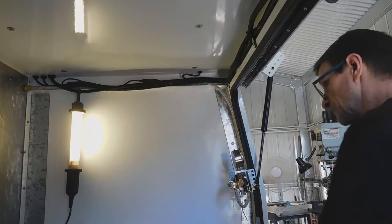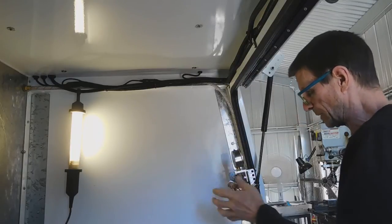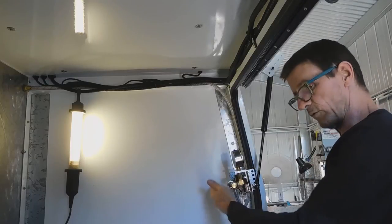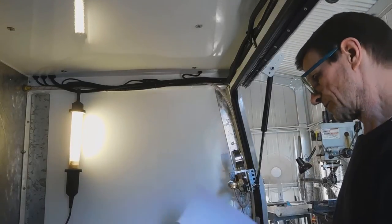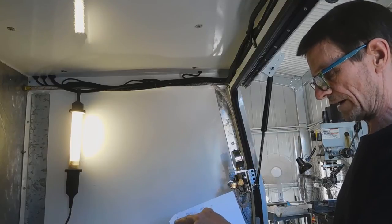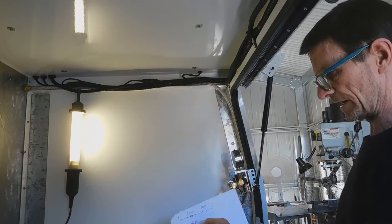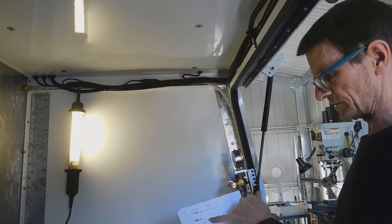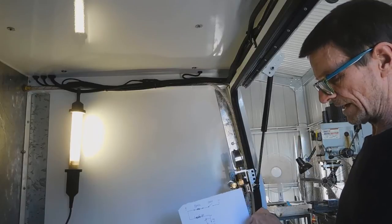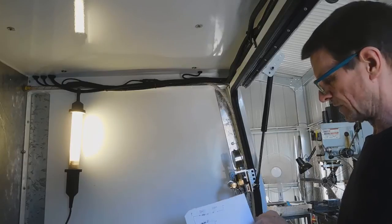What we're doing here is putting in a door switch. The reason we've got a door switch is that we have to turn on a relay to power this system only when they're actually working on it. So we can use two relays - a five pin and a four pin. I'll just show you there's a diagram. We've got a door switch here. Relay one turns on the coil and power here, that provides power also to the output down here. When this relay closes, power comes into the system here, then it goes to the five pin relay. The five pin relay outlet turns the relay on when there's no pressure in it.